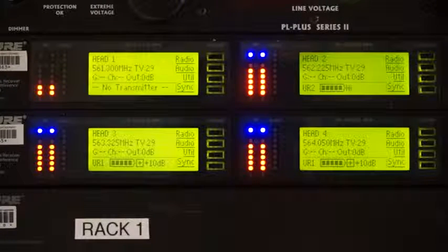It may be a reliable frequency for the most part, but it's possible that if 2 transmitters come into contact when the performers interact, or something else goes wrong, that frequency could fail. If the receiver for a powered down transmitter still shows levels, you need to reprogram that channel to a new frequency and repeat the game.